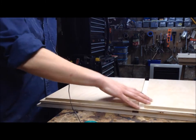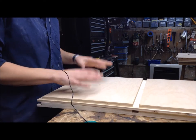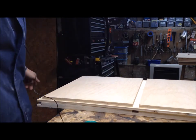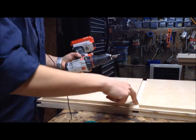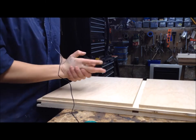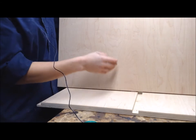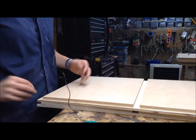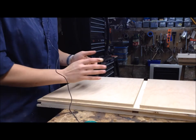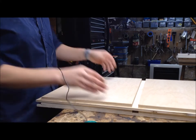I have all of my pieces. I moved them into the basement because it's officially too cold outside for glue to dry, and I let them sit overnight so the glue and the wood would be at the same temperature. Now I'm going to start putting them together. I'm going to use a countersinking bit to countersink probably four holes in each of my dados and rabbets so that on the other side I can countersink as well and put these together using screws, which means I won't have to use clamps. This isn't ideal because on the side of your cabinet that shows, you'll have some countersink holes that will have to be filled — but I don't have enough clamps to put all three together at once, and it's the tail end of the Christmas season, so I'm going to use screws and won't have to use clamps at all.